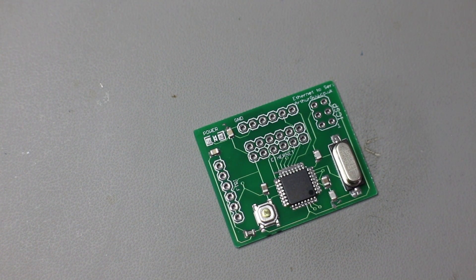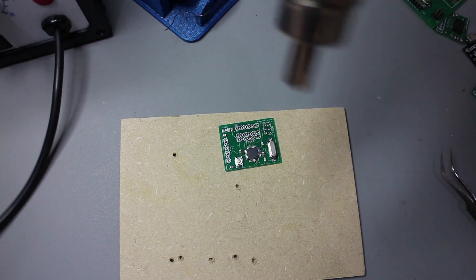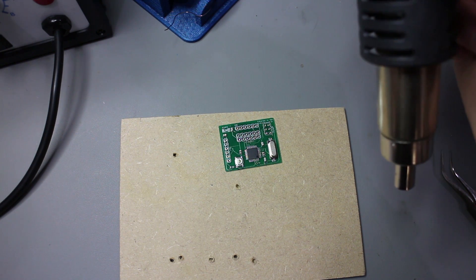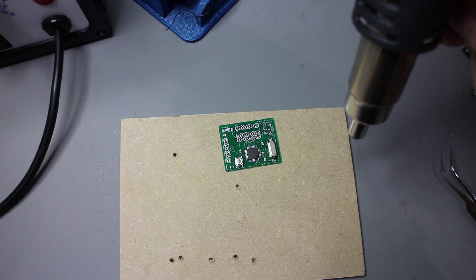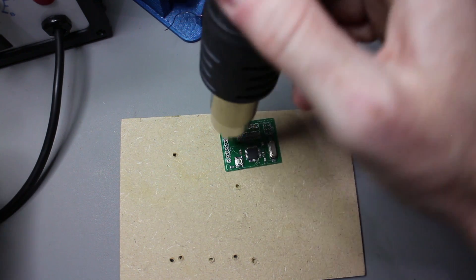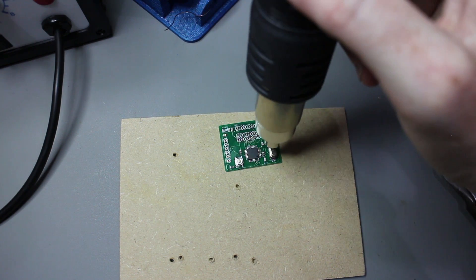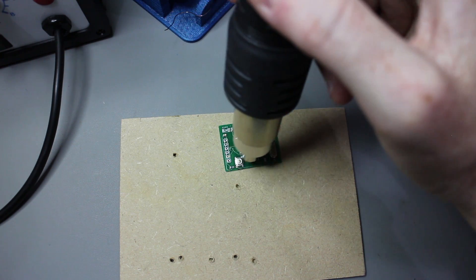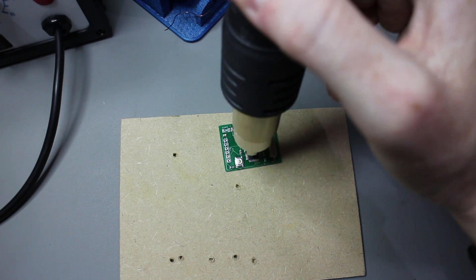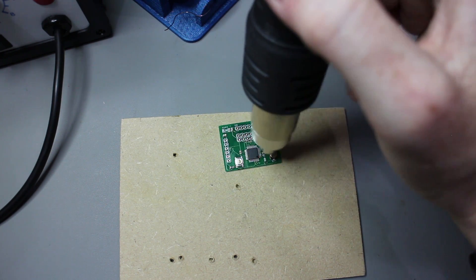All the parts are placed - prep now for heating up. Place the board onto a bit of wood for heat protection, then using the gun. I've put this on a very low speed - on my unit which has a one to eight control, I put it on around three, which is at 320 degrees. The low speed is so the airflow doesn't blow any components out of the way, just relying on the paste to hold everything in. It's a case of going around and heating everything - in a relatively short period of time parts will start to solder.